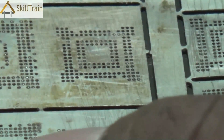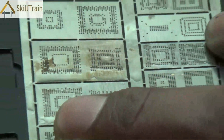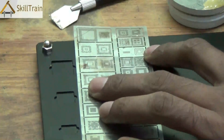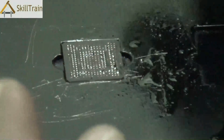Once it's done, you can use thinner to clear off any unwanted substance. Sprinkle a little bit of thinner and wipe it out so that any extra soldering is removed. Use a small brush to clean up. Brushing will also ensure that no two points are joined on the back of the IC, and any excess soldering will be removed. Once you brush them off, you can take off the plate.